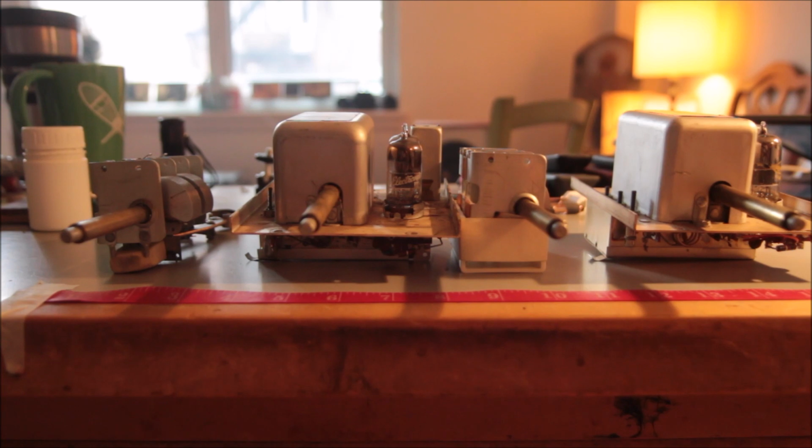Now, all of these components, these tuning capacitors, exist for one sole reason: to narrowly select in on one frequency and one frequency to the exclusion of all others. It is this that allows this front end to deliver a signal to a suitably responsive intermediate frequency stage, a signal that, well, has no comparison, because no one has ever done TRF and FM, except I guess I'm just about to do it.